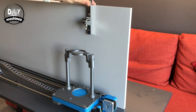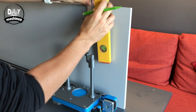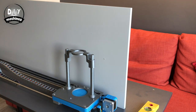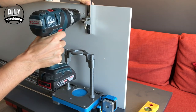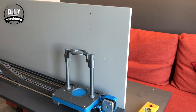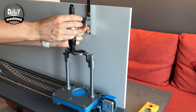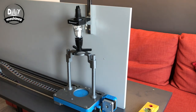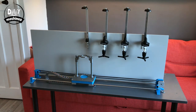Remove the optic from the holder. Reposition the bottle holder on the board above your little mark and then check it's vertical with a spirit level. Mark this point again at the top of the board. Now make some small marker holes — I'm using my drill bit to make a little scratch on the board. Once you've finished the first one, check that the paddle can still move freely underneath the optic. Continue adding more optics; I've spaced mine 12.5cm apart. I only have four for now but I'll buy two more shortly.